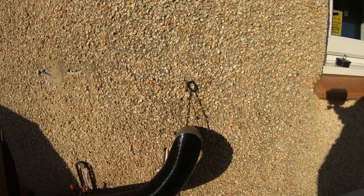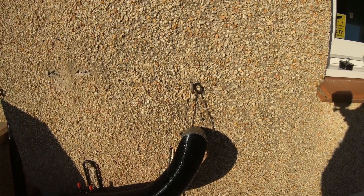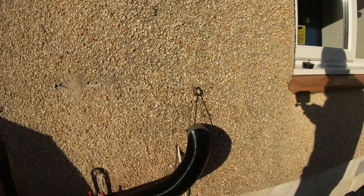That's a 75mm pipe which I had to buy extra of. Where it goes into the house, both bits of pipe have a reducer which reduces it from 75mm down to 60mm. I did that to keep it tidier more than anything — when it goes into the house I didn't want a great big 75mm hole in the wall, so I actually drilled a 63mm hole and put a 60mm reducer in it.